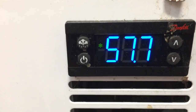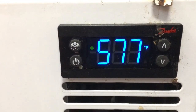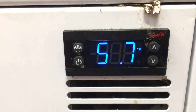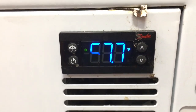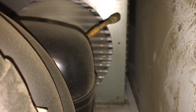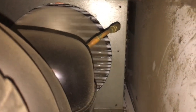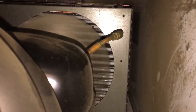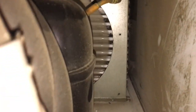We've got the snowflake - that means our compressor should be calling. We've got a compressor. It was 58 degrees, it's coming down. We're pulling warm air, it's not scalding hot. The pressure's warming up, I'm just putting my hand on it right now. It's warm coming off the compressor - probably about 150 degrees here coming off the compressor. It might be a little low in charge or something.